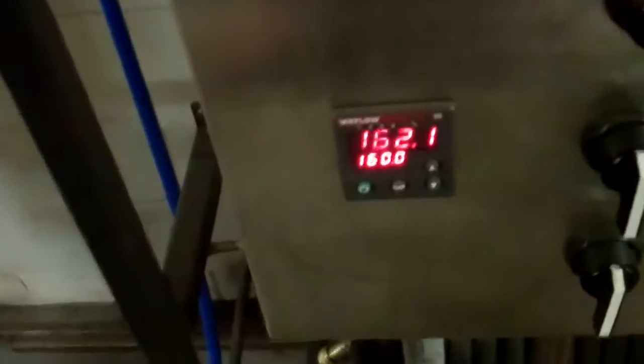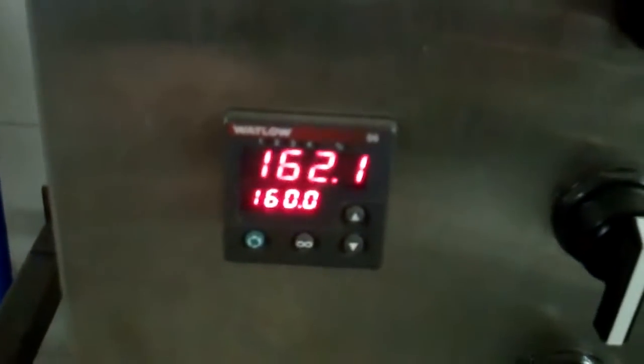It's got fairly precise temperature control — it kicks on and off about every two minutes. That's a temperature probe right here, and I control the temperature of the water in the heat exchanger because that basically dictates how much heat goes into that coil. That temperature probe monitors the heat in the water and is hooked to the temperature controller on my control box. I have it set for 160 and right now it's reading 162, so it just kicked off.